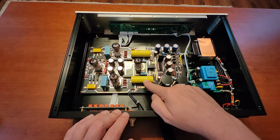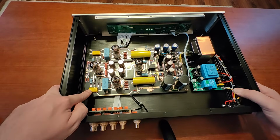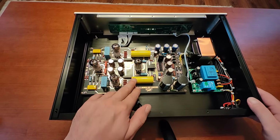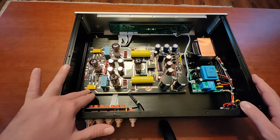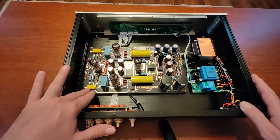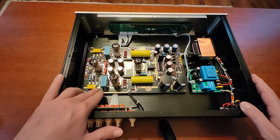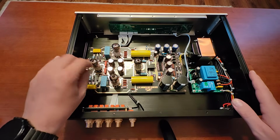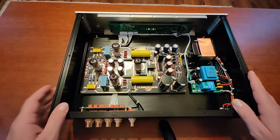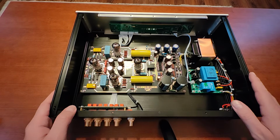These are 10 microfarad capacitors, and the small ones here are 1 microfarad. I'm not sure if I have 10 microfarad Jansens in my drawer, but I'm pretty sure I have some nice Jansen 1 microfarad caps. The red ones, these are not the superior ones. I don't remember the name. So anyway, I'll try to fix that preamplifier by replacing these capacitors, maybe these blue ones too.